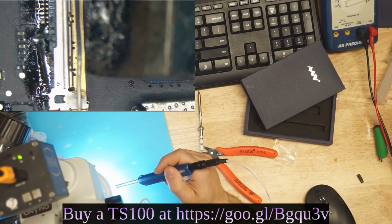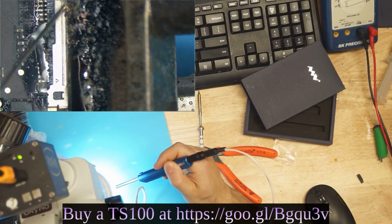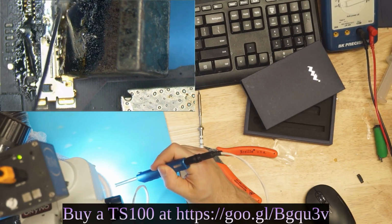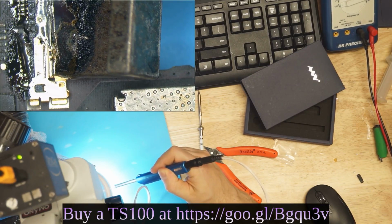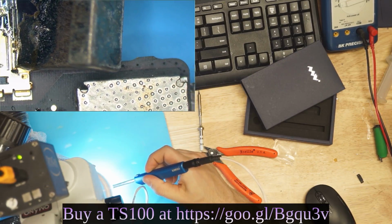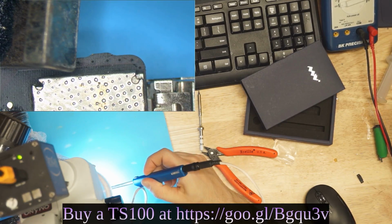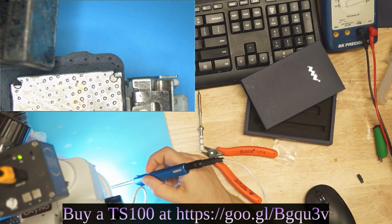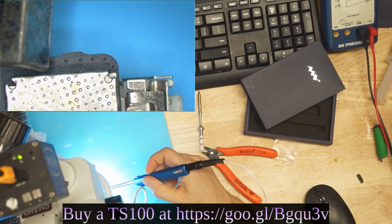Okay, now I'm at 12 volts instead of 24, and I want to see if it still has the power to maintain its temperature into a ground plane. So I'm going to torture it with the largest tip I have, sending it straight into the ground plane, and it seems to be lowering itself down in temperature. It's down to 343, 330. And it's a steady 1.3 amp draw rather than 2.7. It's almost down to 300.